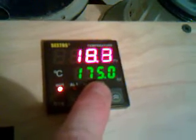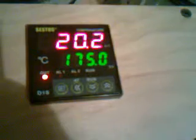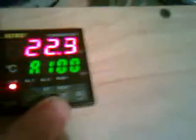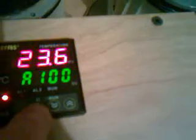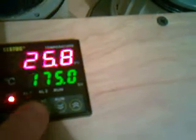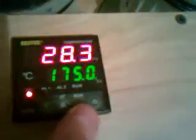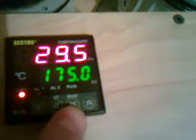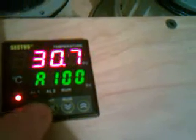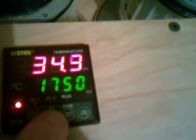175°C is slightly less than 185°C, and what I found was that at 175 the filament tends not to bubble up as it comes out of the extruder. You press Set, then the second button until the temperature comes up. Then you press Run — see it flashed there — and then you move this button which moves the cursor along.